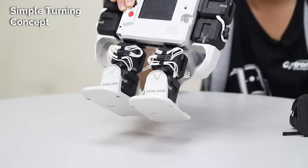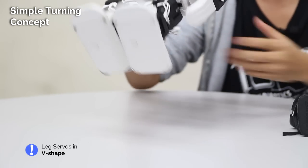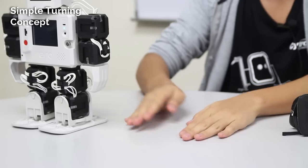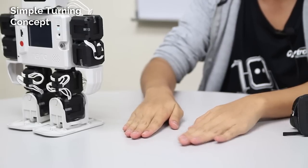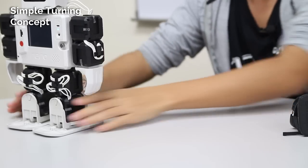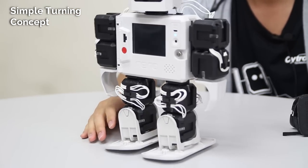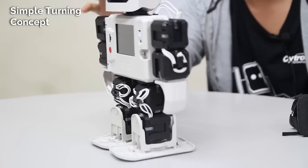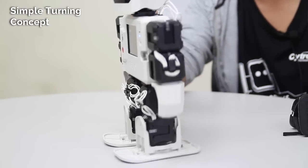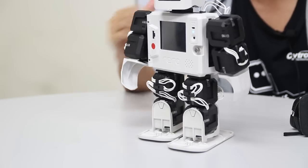The difference is in the leg servos. When walking, the legs shuffle forward, but when turning, the legs are always in a V shape — you lift up, shift to one side, then shift back in. I'd like you to experiment with the turning sequence on your own, because it's better to challenge yourself. Trust me, it's very similar to the walking program, and if you just reverse the process, it can make the robot turn to the left as well. Since the robot can move forward, it can definitely walk backwards too — it's just shifting the body weight backward instead of forward.